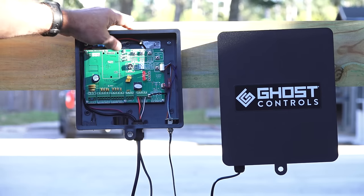If you are using a vehicle sensor with your system, establish the placement of the sensor coil and dig a trench at least 12 inches deep from the sensor to a spot underneath the control box. Make sure the sensor is placed parallel to the drive and not perpendicular. Make sure that no vehicles or other metal objects are near the sensor, and attach the sensor wire to the control board as shown. Attaching the sensor wires will automatically calibrate and program the sensor.